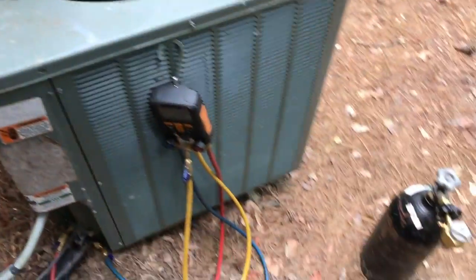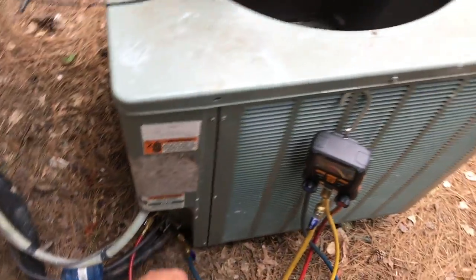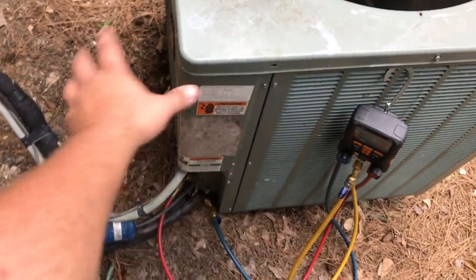So this is why you have to be thorough. I put the pound of refrigerant in it and I didn't find anything at the air handler with my leak detector. When I searched with my leak detector right here, I just checked the valves down there and ran it around this side of the coil where the distributor tubes or the capillary tubes are, and didn't come up with anything out here.